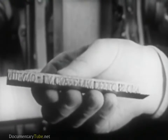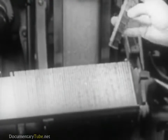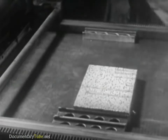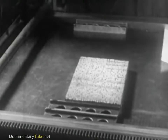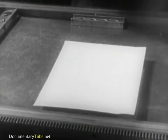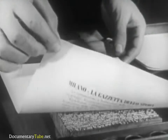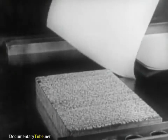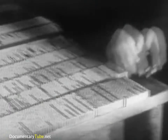Here is a slug or line of type turned out by these machines. The lines of type, properly arranged, make up the page from which, after inking, the imprint or proof is made. The function of the keyboard composing machine is to produce the essential materials required to prepare a form for printing.